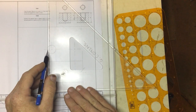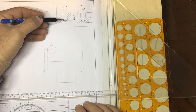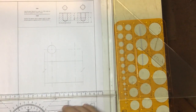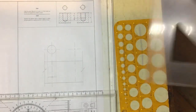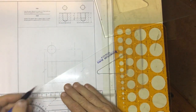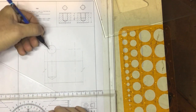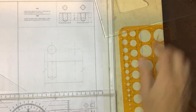I'm going to drop some construction lines down. The depth to the base of the hole is 25 plus 10, so that's 35mm — measure that off on the center line and draw a nice dark line across there. Then draw lines straight up on each side, and take your 30 degree set square to draw the angled lines at the bottom — that represents the pointed tip of the drill bit.